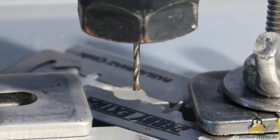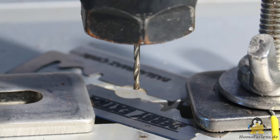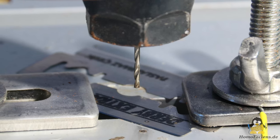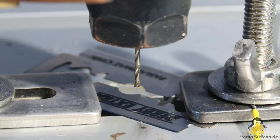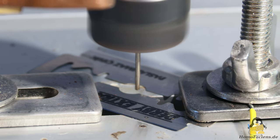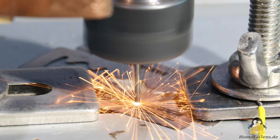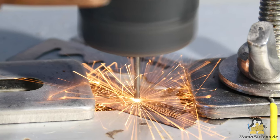How does spark erosion work? The drill is slowly brought near to the surface of the razor blade. In the electric circuit composed of the charged electrolytic capacitor, the copper wires, the chuck and the drill bit, as well as the air between the drill tip and the razor blade, the latter has by far the highest resistance. Almost no current flows out of the capacitor. However, if the air gap becomes very small, a spark will jump over at some point before the drill touches the razor blade. There is a lot to say about the process of spark formation, which I will explain in more detail in a later chapter.